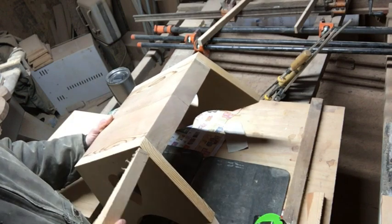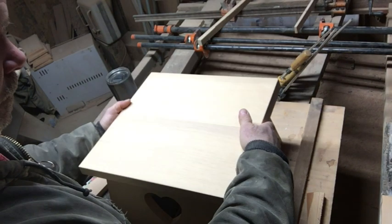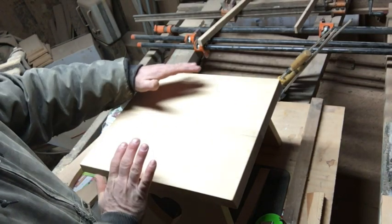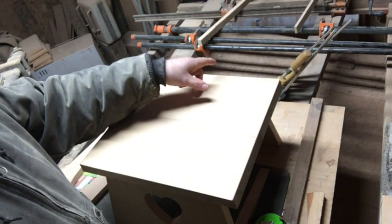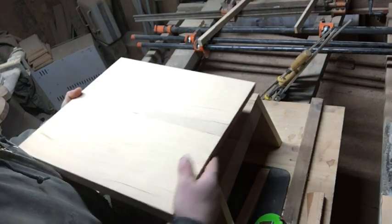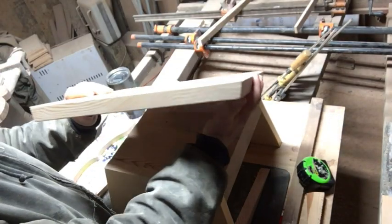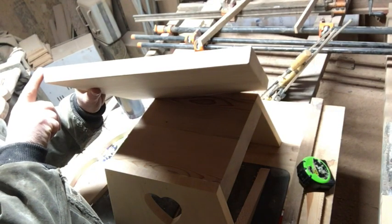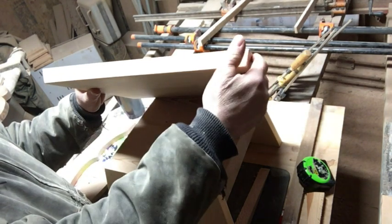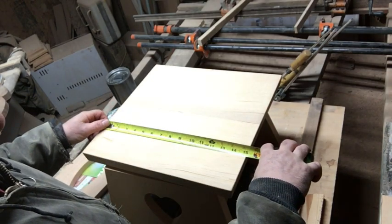This face here is cut 90 degrees. This base portion I made out of cedar, and all the cuts are made 10 degrees as well to follow this slope down. So it's 10 degrees this cut, 10 degrees this cut, the top is 90 degrees on this edge and 10 degrees on this edge. When I butt these two together - this is 90 degrees - I glued and clamped these together with the bar clamps, let that dry, then sanded everything down and rounded the corners at seven inches from seam to edge.